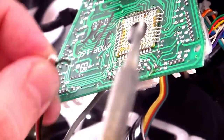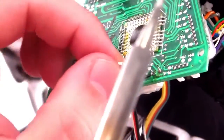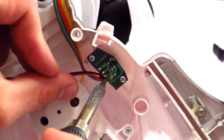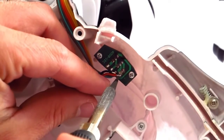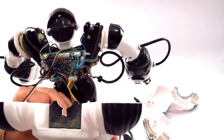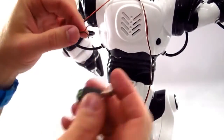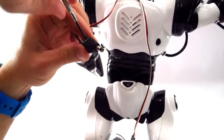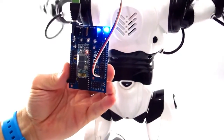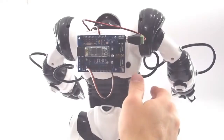Tin the end of your wires. On the version 1 RoboSapien, undo the screws and expose the circuit board. Solder the white wire to the pad on the back labeled IR, and solder the black wire, which goes ground, to the ground connection shown in the video. To power the EZ-B, we're going to take power directly from the switch. Cut a small hole in the back behind the head to let the wires run through. Now let's put it all back together. Connect the power wires to your power adapter.